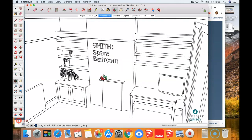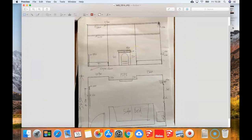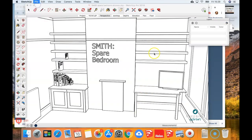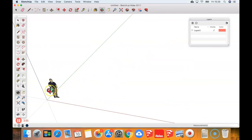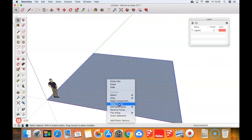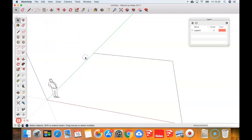Having cleared that up, let's move on to creating a drawing like this. It starts with a sketch — I go to see the customer, talk through what they want, and do a sketch like this. My usual format is to draw at the bottom of the page a plan with dimensions marked on, and roughly in line with that I draw the elevation. That's as much as I need to then reproduce it in SketchUp. I'm going to be working in SketchUp Make. I start a new project, and I like to have a floor plan — I've just selected the rectangle. I'm going to group that so things don't stick to it, and I'll make the face style hidden line under View > Face Style, so it's just a line drawing. That's how I do most things I present to customers.